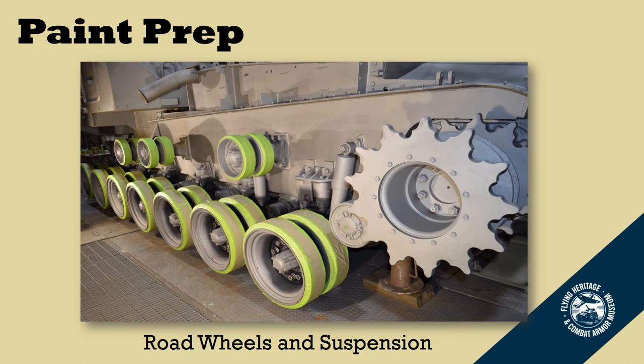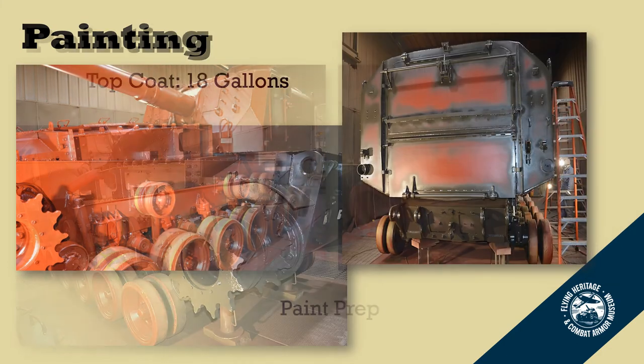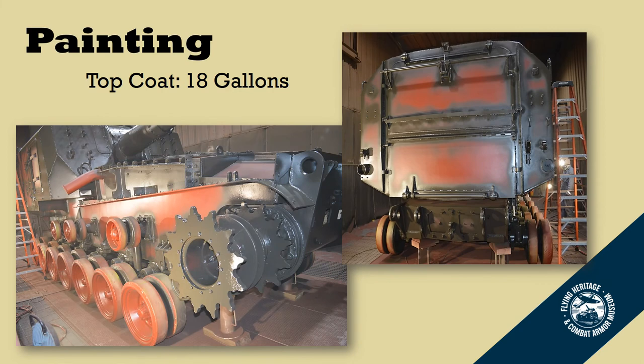Some pieces were pre-painted and then assembled, and you can see we've also masked off the rubber on the road wheels and the return rollers. The primer was a red epoxy — we custom-tinted it to match as closely as we could the original color of the primer that was on the gun. Then it was time for a top coat: we sprayed approximately 18 gallons of top coat, a custom PPG acrylic urethane color mixed to match a federal spec paint code specified by the museum — and to my excitement and great joy, it's Marine Corps green.